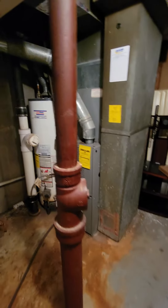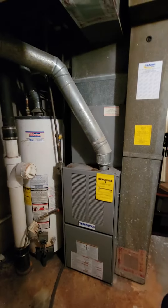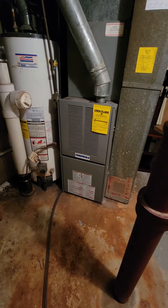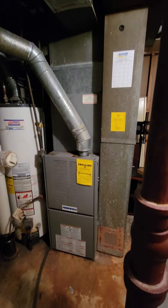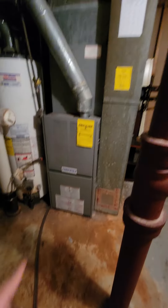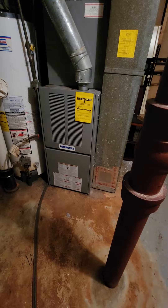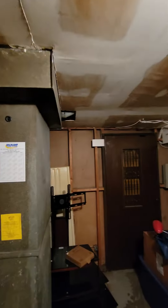We're looking at some options — maybe just doing an air conditioner and coil, but hopefully we'll have an option to do the furnace as well. They have either a three or three-and-a-half ton on the ground, with a one-inch filter in the bottom portion of the furnace cabinet. We'll be able to get in our five-inch filter, though we may have to do an offset because we don't have much room over here.